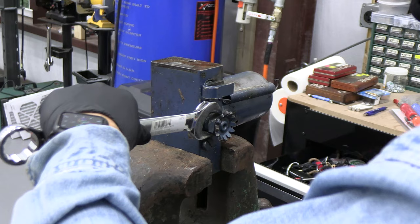Here we have an adjustment, we've got a seat, a new O-ring, and then we've got actually two ball bearings. So we have to be cautious with that to be sure that we replace those. And there's an O-ring right here, or a washer, a black washer. And so we need to put a new one of these in, which I did. A new seat, which I did. A new small and a new large ball bearing. And then we can replace this.